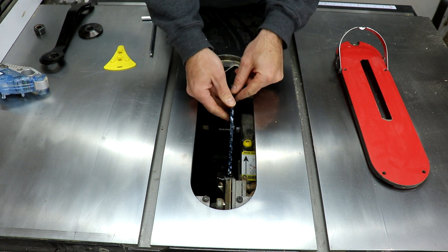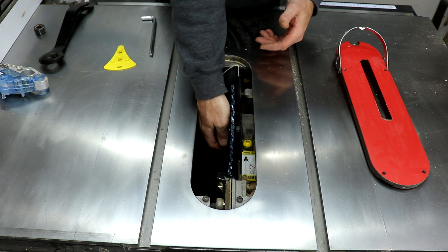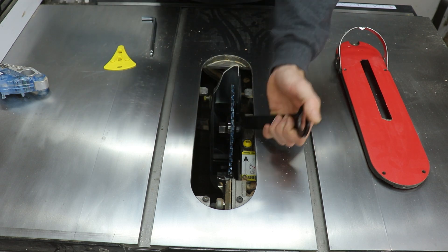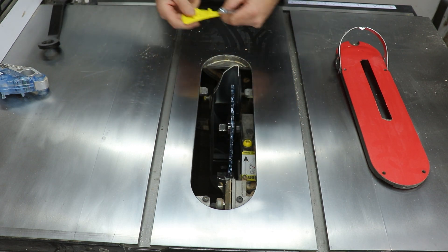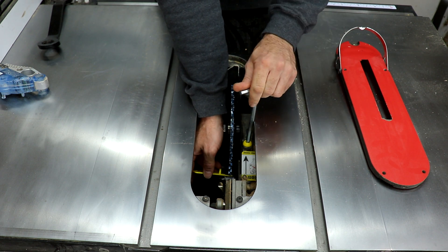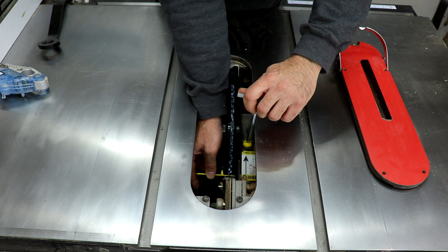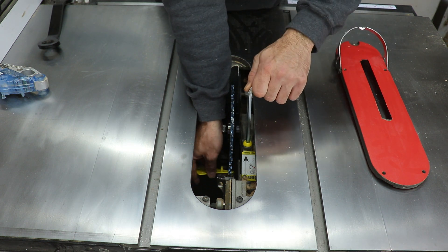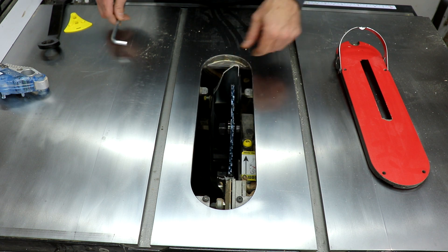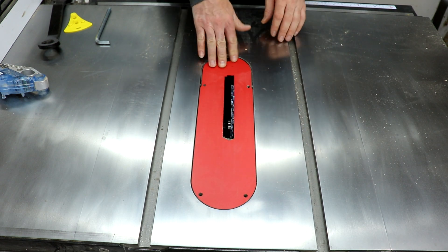This is just a quarter inch stack — two of the outside cutters — but it's basically the same process. Go back in here with your gauge, tighten it up so it just barely touches, top and bottom. Just about good — you can rotate it to make sure it doesn't hit. Take your dado insert, make sure it's flush, lock it down, and you're good to go.